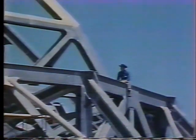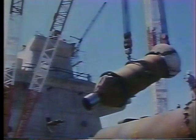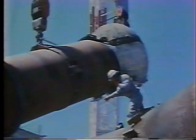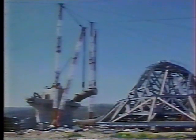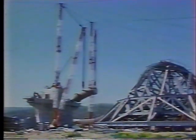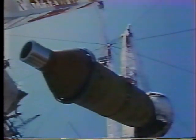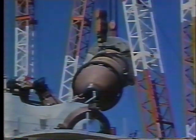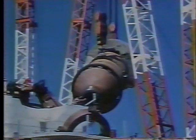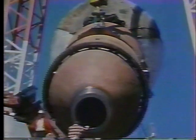Its center of gravity was located and the pick points were set so that at none of the lift angles to follow would either derrick be overloaded. No miscalculations allowable here. Some doubted the calculations. The shaft was tilted to the required angle. Telephone control was established at each winch house in order to be sure that one derrick did not get ahead of the other. Clearance between the derricks was not enough to pass the load straight through, and so it was angled between the two booms.